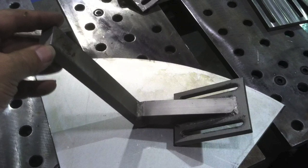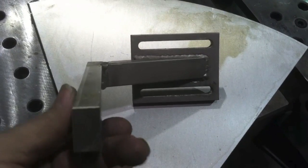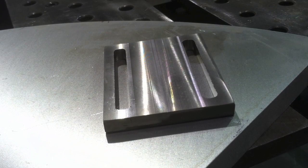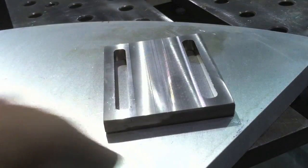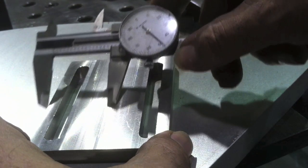It looks just like this. We're gonna make two of them and I'm going to use some of the tooling and the precision table to whip out two really quick. Get them fit up. The machinist cut the angles and got all the solid bar stock ready. Started off with this flange plate. I want to make a center line on it and I'm going to use the calipers here to scribe a line.